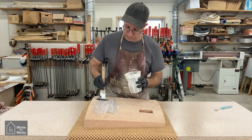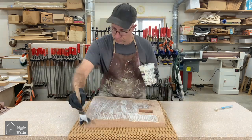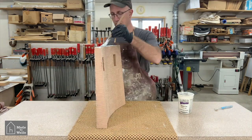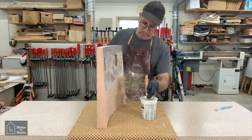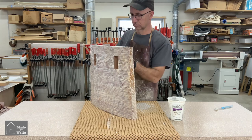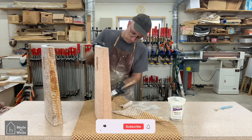The coloring was applied using the Old Fashioned Milk Paint Company's base no-pigment paint, mixed a little thin — about three times the amount of water they recommend. It's put on with a brush, and it takes a bit of work to get it onto all sides while keeping it fairly wet. I left it for about 10 minutes after the first coat on all surfaces, then went back around to hit everything again to make sure things stayed wet. The coloring process actually happens really quickly.